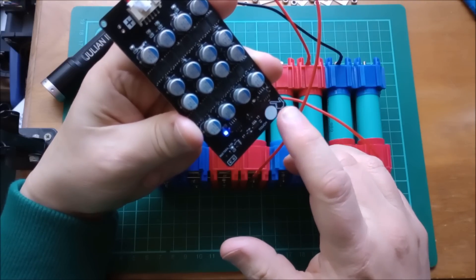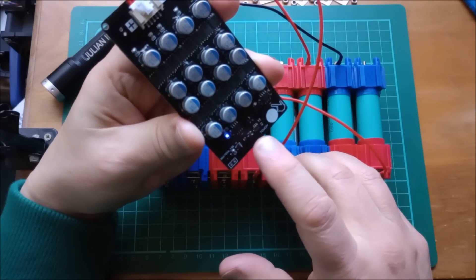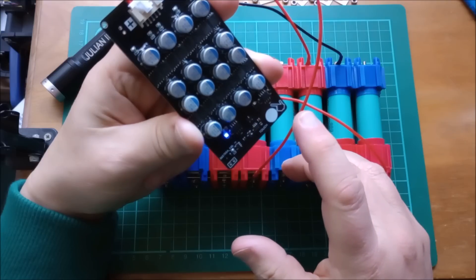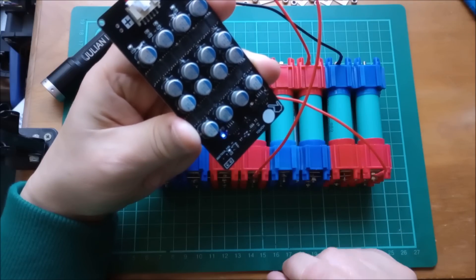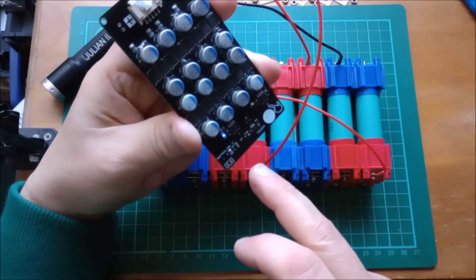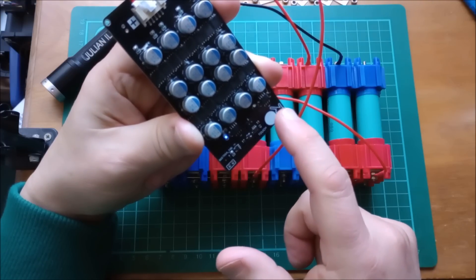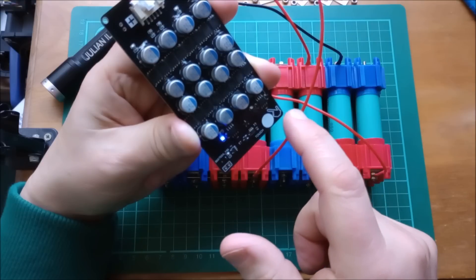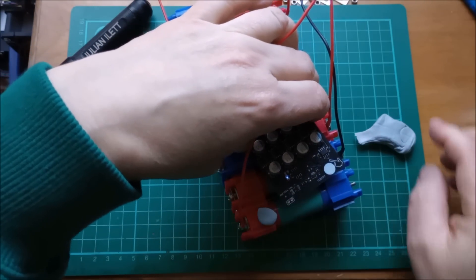Touch on, touch off. The only problem is the blue LED fades out really very slowly. I think it's fading out now. Press the touch switch to turn it on, press the touch switch to turn it off — but you don't see the result immediately, it takes a while for that blue LED to fade out. The camera enhances that effect because it's very dim but the camera picks it up quite bright. So yes, it does seem to be a toggle — alternating between two states.